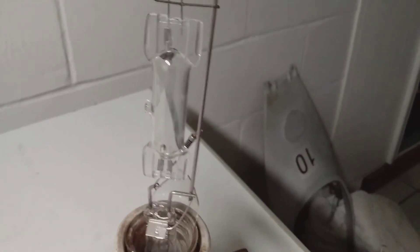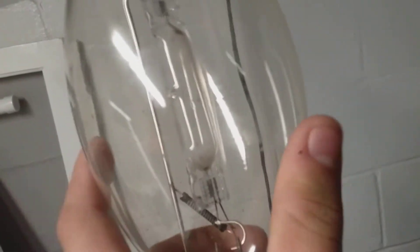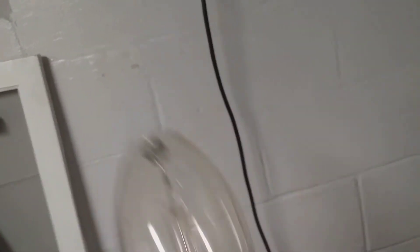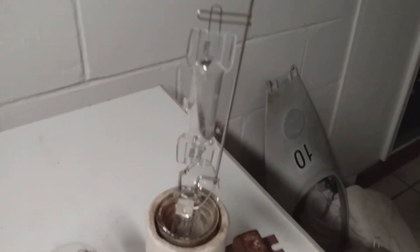The way this works is the arc tube right there is quartz glass, which lets UV radiation from the electrical arc right through. This outer bulb here stops UV radiation — it only lets out visible light photons and absorbs the UV photons. This one, with the outer bulb removed, lets everything through: infrared, UV, and visible light.